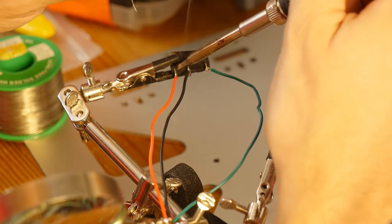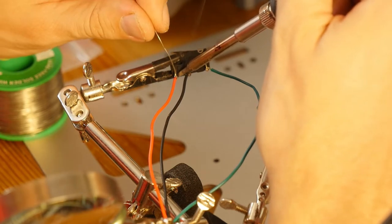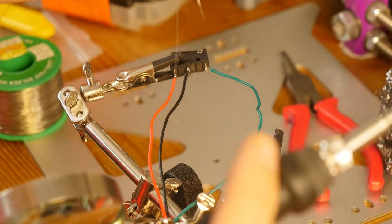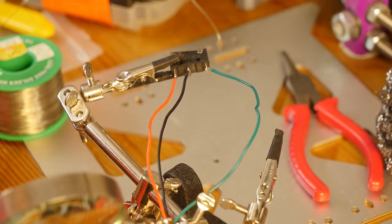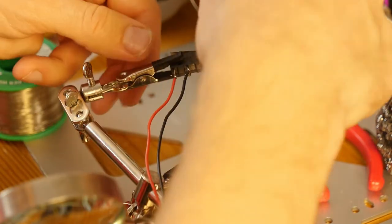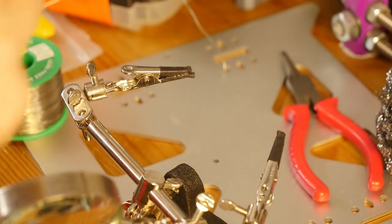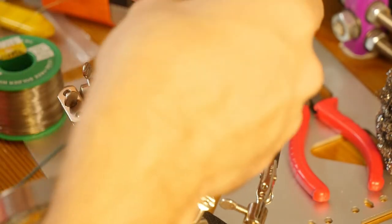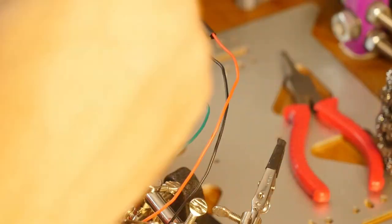And let's do the last one. I think I might have damaged both the plastic housing of the end stop and also the wire insulation. Now, since I'm too lazy to go and get a heat gun, I'm going to drop the temperature to 200 degrees, and while the iron is cooling down, I'm going to take the heat shrink and try to insulate all of the connectors. Okay, so I got this. Again, I'm grabbing the end stop.